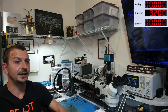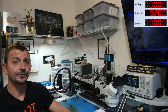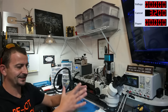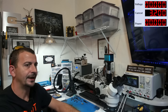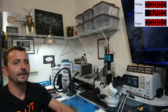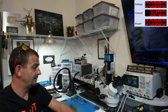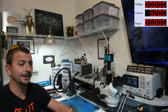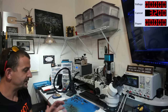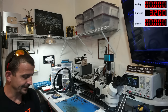But anyways, I did the same exact process on that, the same routine. Got the data, no problems. So after that, I took that customer's chips off of my known good board, put the previous guy's stuff all back on there, and I was right back to having the brain deadedness. So I guess what I'm getting to is that if I hadn't done another one right after that, and probably a couple of dozen or more before that, I wouldn't have known that one wasn't my fault. So it's really good to know what's supposed to work and what's not. And I just moved the problem from one board to another, and it's the CPU.